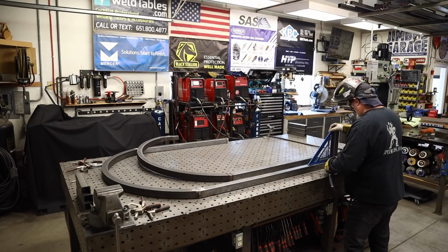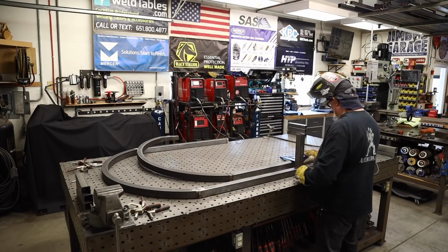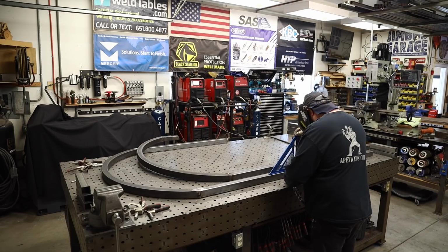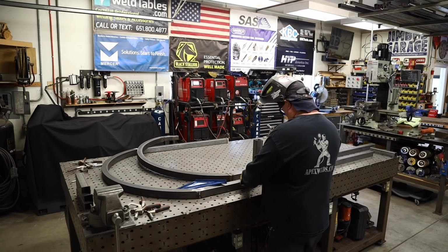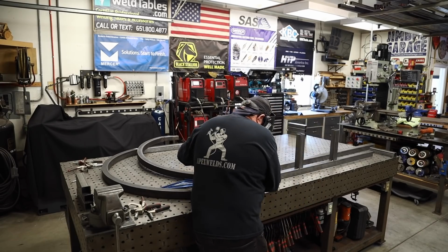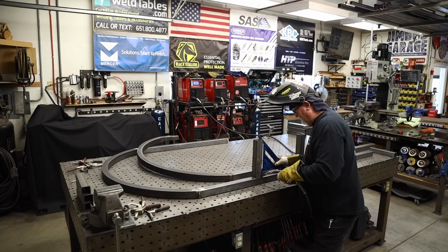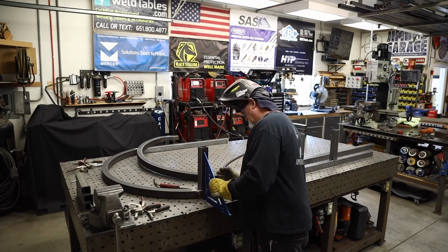All right, these are the spacers that I'm putting in, and this is going to separate the two pieces to create the arbor. These pieces here are right around 12 inches, 11 inches maybe, something like that. The overall width of the arbor is somewhere around 13.5 inches. I had to make it that wide in order to accommodate the existing planter that's in place and where everything is located.